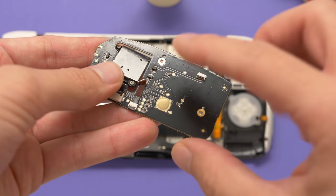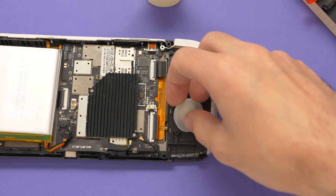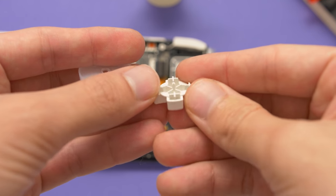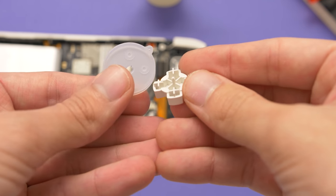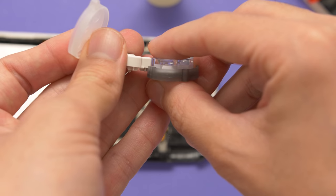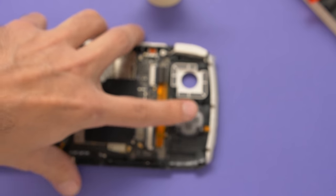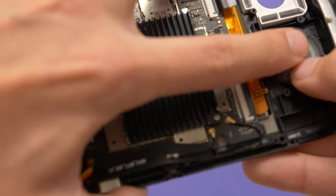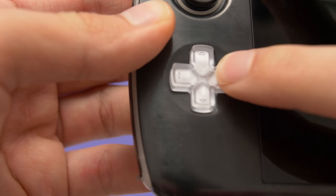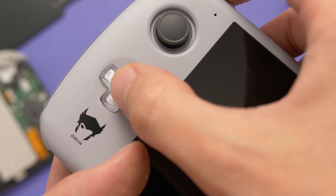Here is a close-up of the left controller PCB. The first thing I want to show off is the D-pad. This D-pad is supposed to be connected to this piece of rubber, but it is not on this prototype. The cool thing about this D-pad is that it's almost a one-to-one clone of the Vita D-pad. With a bit of work, this means you can technically use real Vita D-pads in Odin if you wanted. Without some DIY, I don't think it feels as good as the official D-pad, but you could make them identical if you want to spend some time swapping over the rubber pieces and making small adjustments to the bottom of the button.